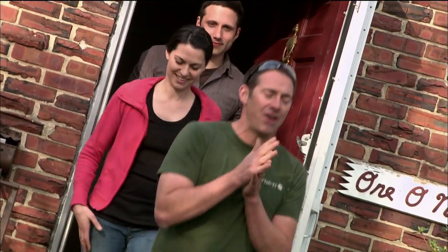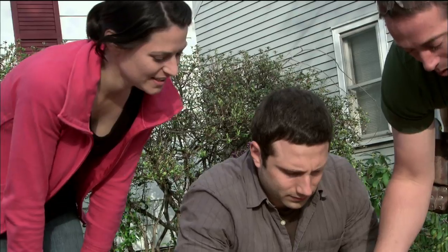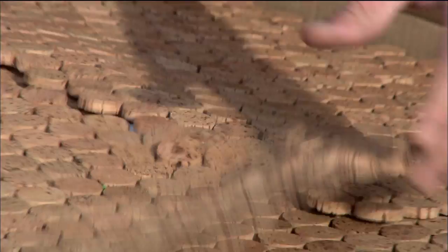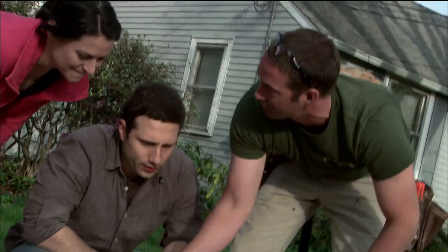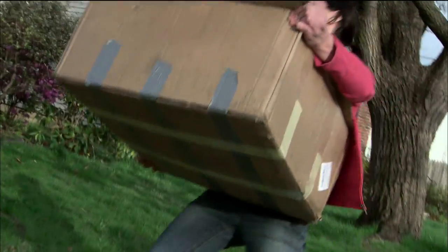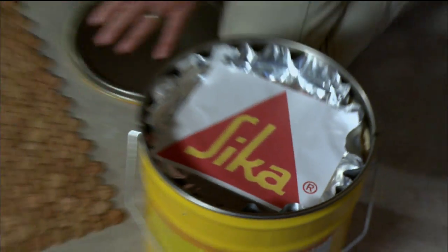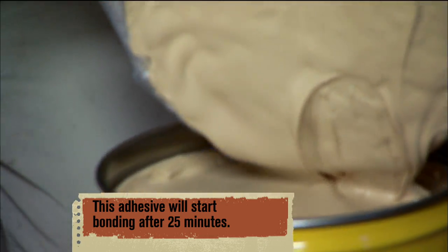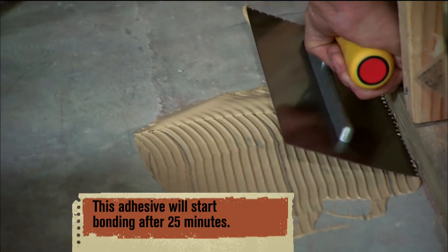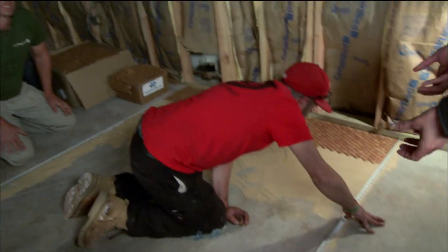It's time for some very exciting news — it's on to the flooring. Environmentally friendly, all natural, post-industrial use corks from the wine industry. Comes in tiles just like this. Lay it down, grout it, boom — you got cork floor. This is how we're going to put the stuff down. This is an adhesive; it's great for concrete floors. They apply the adhesive at a 45 degree angle. We're about to lay some tile.